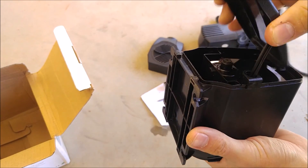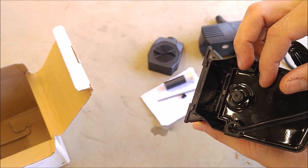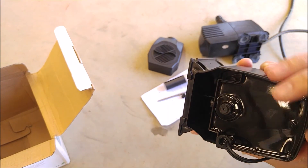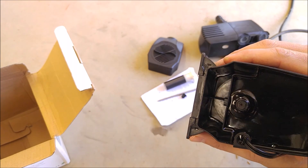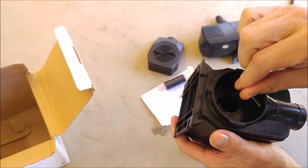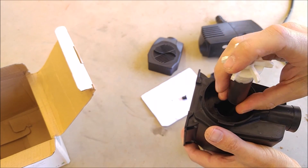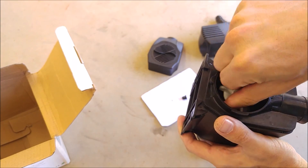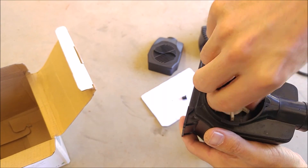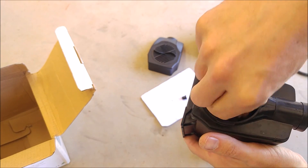That's pretty basic — a lot of them operate like that. I do believe the Eco Pump uses ceramic parts, whereas these are all plastic. In the back of the pump you can see the epoxy enclosure for the actual transformer elements of the pump. That's it for the build — pretty basic setup, not much to it. The fact that you can take it apart and clean it is a huge plus. You can feel the cogging of the element pretty well, and to me that means it's got a pretty good stator element design.